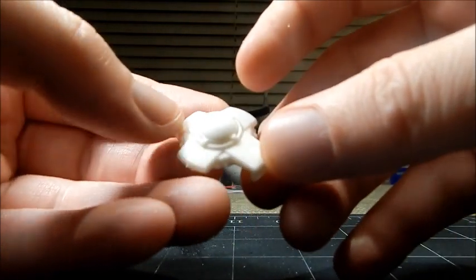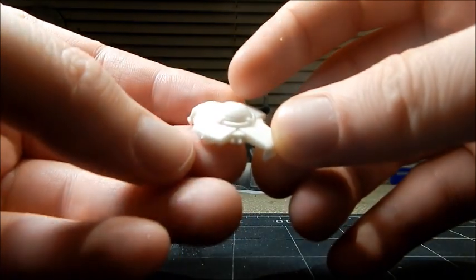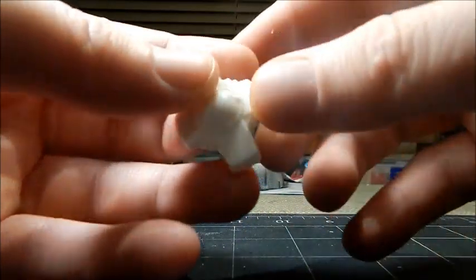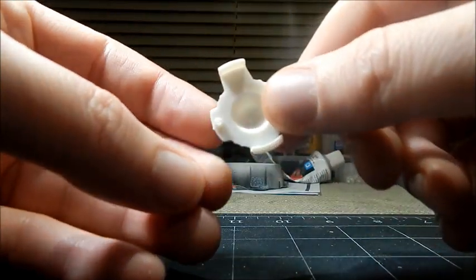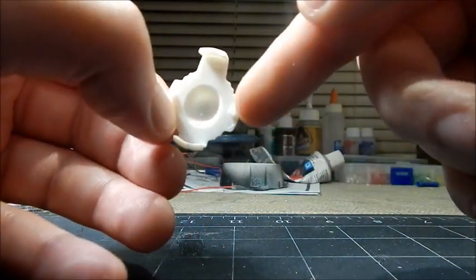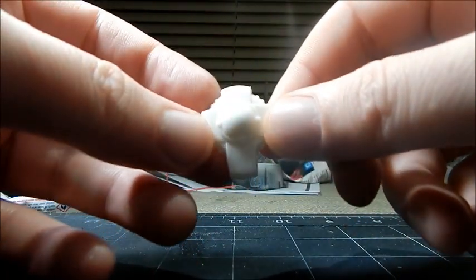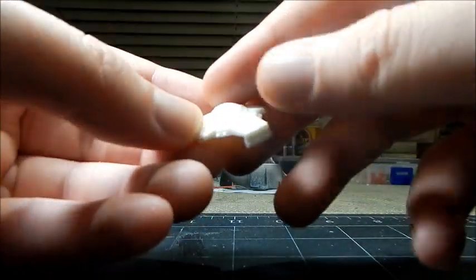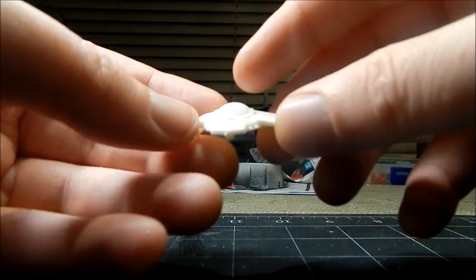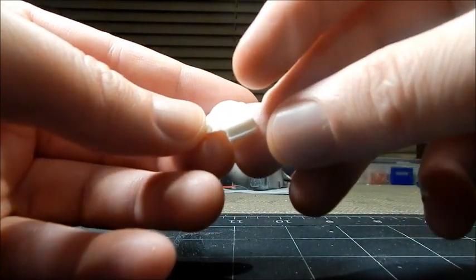This is going to require more work. We have tabs and we have a couple of recesses, or rather receivers, we need to get rid of. That one on the back has to go. There are a couple of receivers, pin receivers, or pins. I'm not sure what they are. Those got to go too. And then we have to file out recesses on each side. On the front there, on the side there, on the back. So quite a bit of filing to do on both these parts.